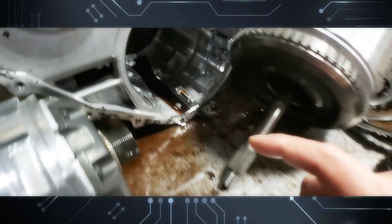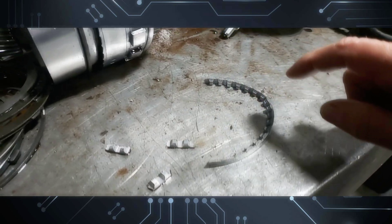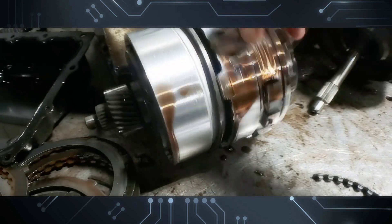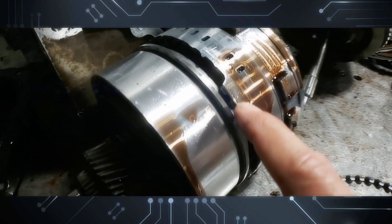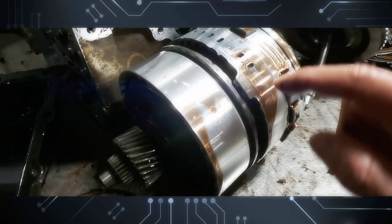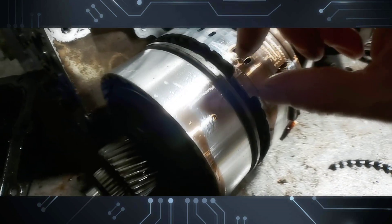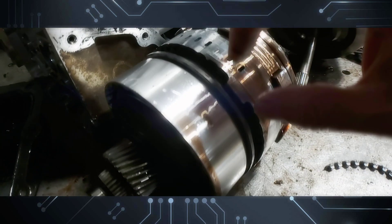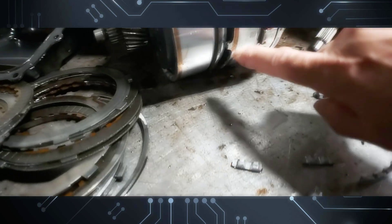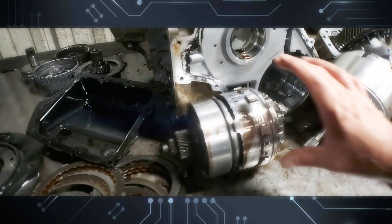It was acting very weird. As you can see, part of the drum is still stuck right here where it exploded, and here is part of the drum that holds the snap ring. What holds the snap ring is completely gone — we only got one piece left over right here. The snap ring didn't hold right here; the opening was right here and the other opening was on this other side, so this piece is still intact because the snap ring was not holding there.